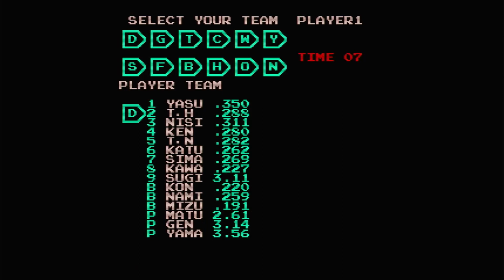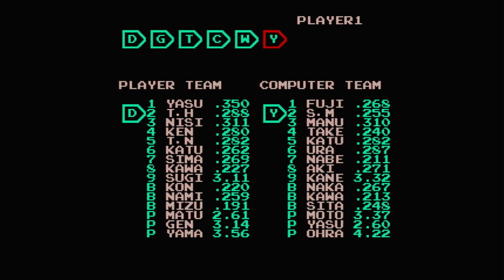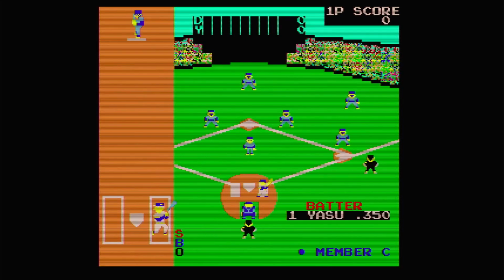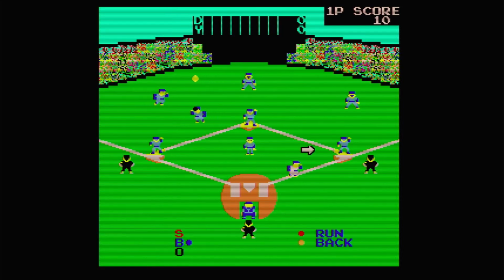So you can see here we've got Champion Baseball playing. I'm happy with that. It's got this board working again. Just a quick video to show that these Mitsubishi chips can be a bit troublesome sometimes. Search around, try different setups in your software for your USB programmer. I found an alternate one there that you can try out. The key maybe is the 25 volt level. That worked for me, and maybe it will work for you in the future.